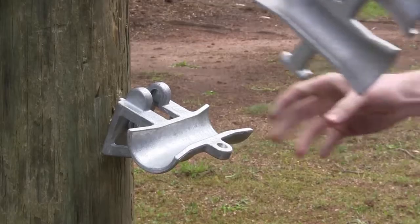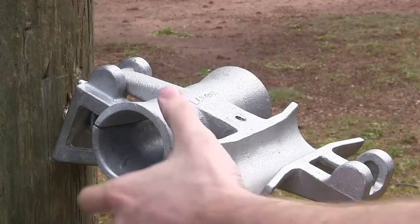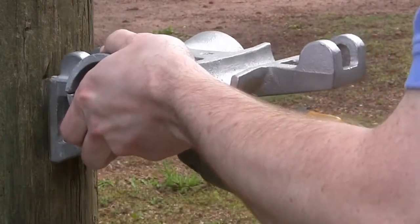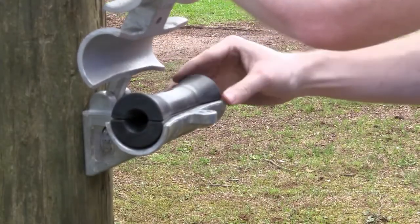With the adapter at a 90 degree angle from the trunnion base, drop the adapter attachment point into the slot and rotate to engage the attachment. Mount the trunnion back on the wood pole using the customer supplied attachment hardware and impact wrench. Secure the first bushing set by installing the adapter body with the original 3/8 inch bolt removed in the second step.